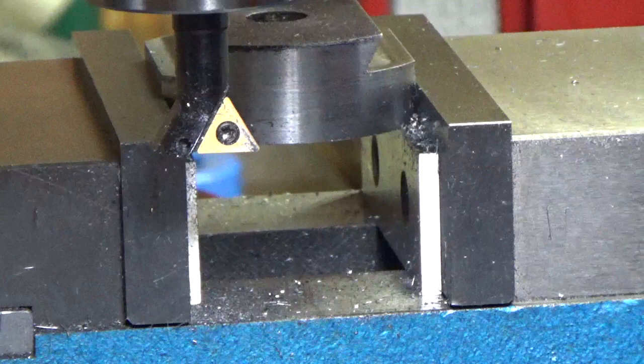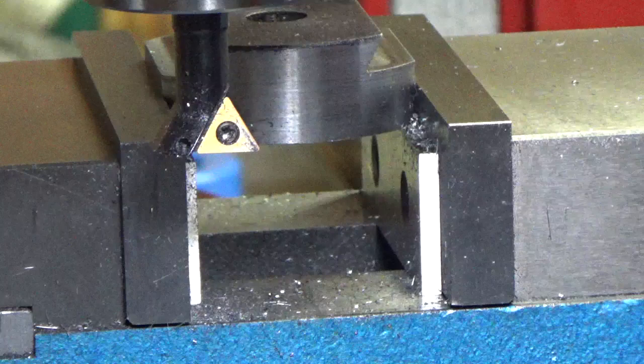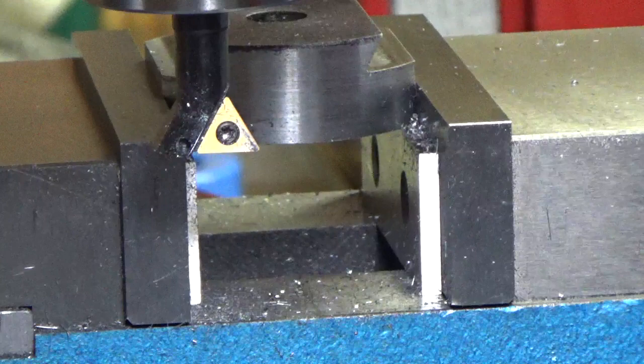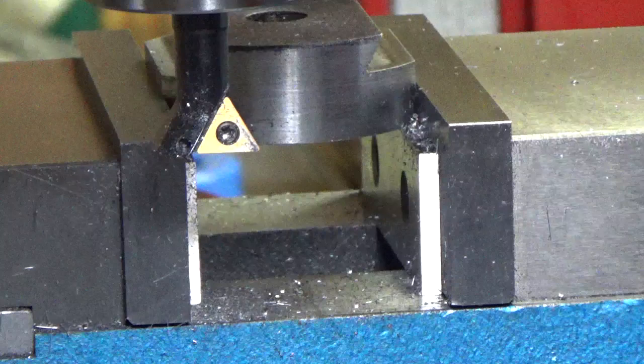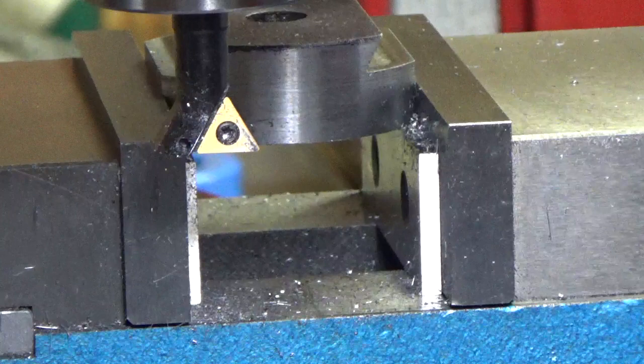I use this on the shaper front unit. I think those dovetails were about 1/4 inch deep too, and this seemed to work pretty good. I couldn't do the female dovetails with the larger diameter cutter. The one I built, the Randy Richards cutter, was too large to fit in there. So I needed a small cutter like this.